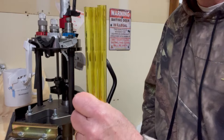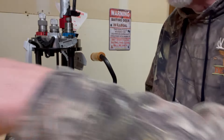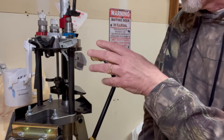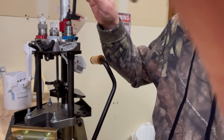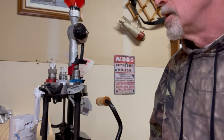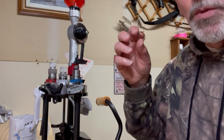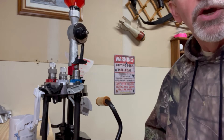I don't think I will ever buy a .30 caliber die — I don't load enough to bother to use this press for it — but I have them just in case. The bullet feeder die works excellent, and I think the primer with that fix is going to work fine too. Still a little bit of issues with the drum powder measure — with that fine Winchester 231, I was getting some leakage. So I've tightened that up and I'll try it again. There's also a fix somewhere — I saw a video about taking those drums, which are really rough, and smoothing them up a little bit to keep it from leaking powder so much. So maybe I'll try that in the future.